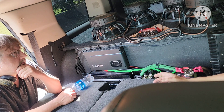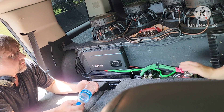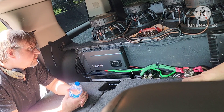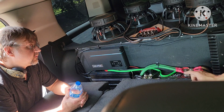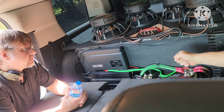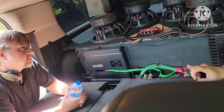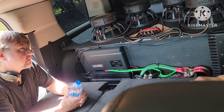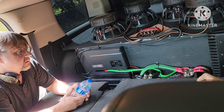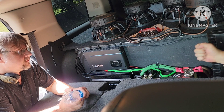So if you take this battery over here — it's got all the storage — and you've got the supercapacitor that allows it to fill up and give you a burst, it's constantly getting filled up by the battery. Whenever the amplifier needs that dynamic power — that boom, boom, boom — this guy can provide it. While it's losing its charge, the battery is filling it back up in one steady stream, providing the pulses going to the amplifier.